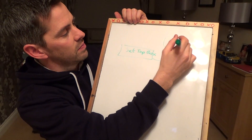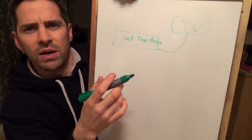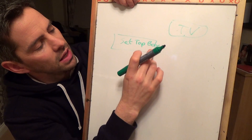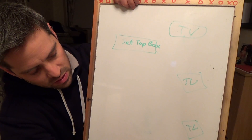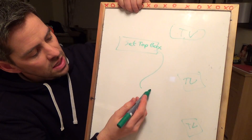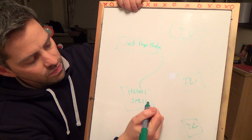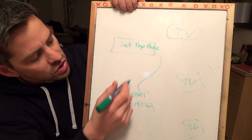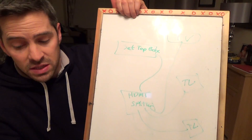Normally you would have a HDMI out from your set-top box into your TV and it would work fine. But let's say you want your set-top box to work on four different TVs in the house. Instead of putting the HDMI cable directly into the TV, all you do is run HDMI out of the set-top box into a HDMI splitter — also called an amplifier — which has one input and four outputs. Each output goes to each TV, and it is as simple as that.